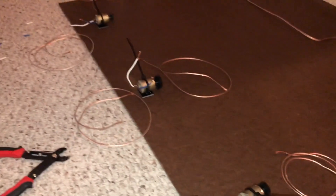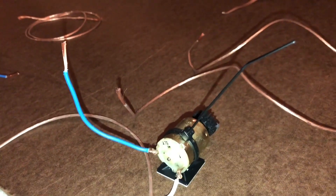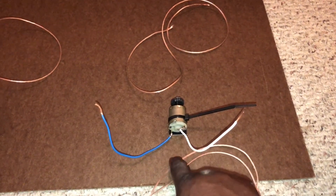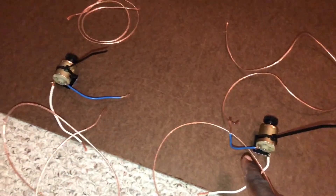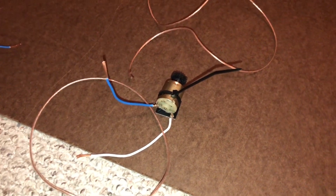I've organized it all the way around the board so I know what goes where. All of my boards have pre-measured mounting pads — the mounting pad is exactly seven and a half inches from the edge, and each motor is 12 inches from each other, all the way around the board.